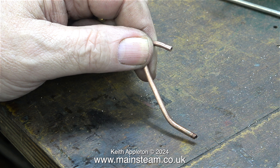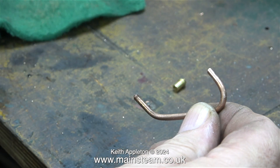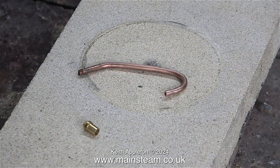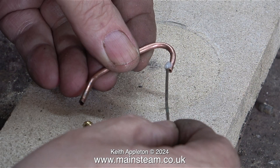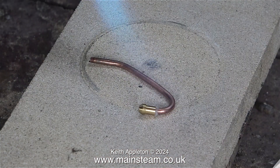I chopped off the end of the piece of pipe using my bandsaw and now it looks like this. I'm going to silver solder it, and before I do that it needs thoroughly cleaning in the area that I'll be soldering — the cleaned end is much shinier than the other end. Into the outer part of the workshop for a bit of silver soldering. The job begins by coating the area with some silver solder flux — this is Easy Flow Number Two.